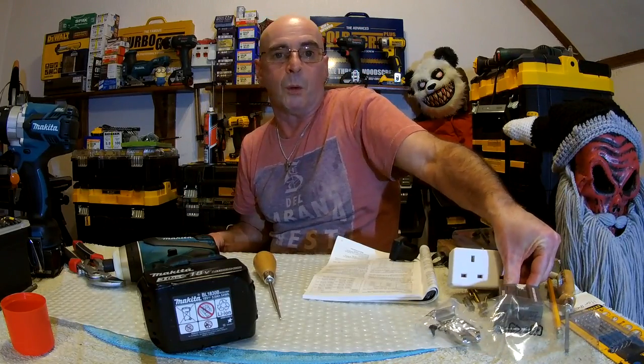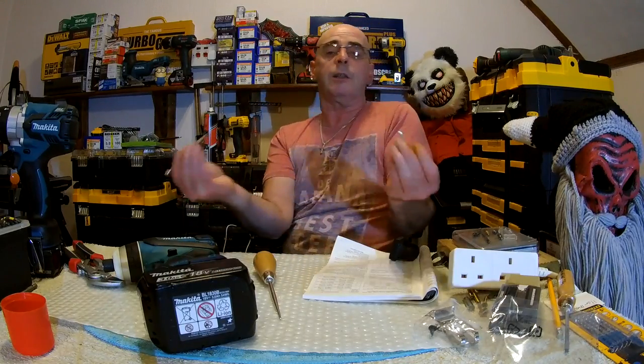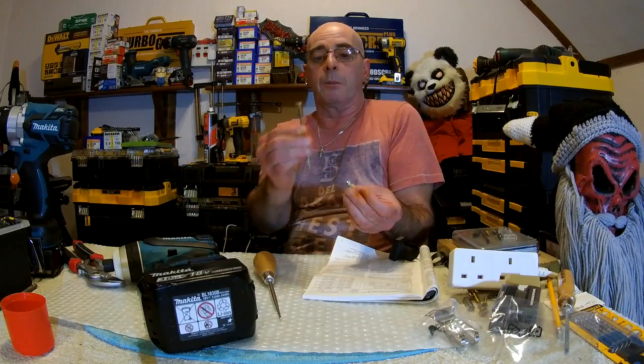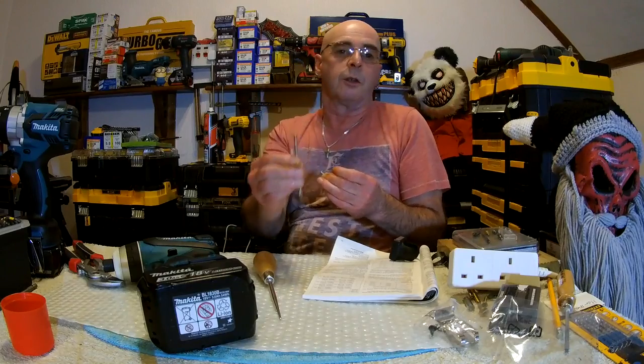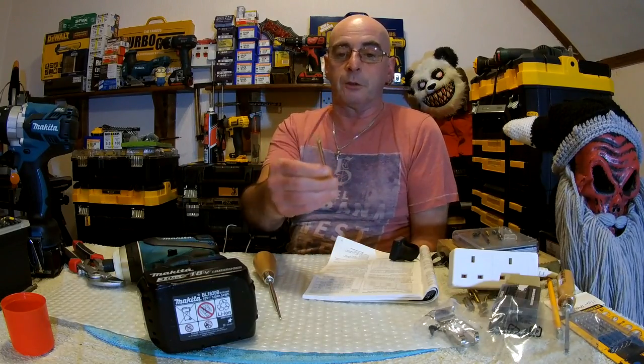Because as I've found, with countersink screws, or double countersunk screws, the problem with the E-clutch is it'll either underbury it or overbury it in wood. I've proved this with a DeWalt. I've done a video on this showing you what actually happens, that they're not that good. But when it comes to pan head screws, bolts, nuts, they're brilliant. I will not fault them. That's a pan head, but that's a pan head with a washer. If you use normal pan heads, they will actually stop because they offer resistance when this bit here hits the wood. That's fine. I'm not against E-clutches, but when it comes to these, I call them double countersink screws. The wood elves actually call them flat heads. So it's a double countersink screw with a flat head.